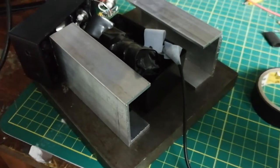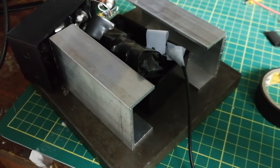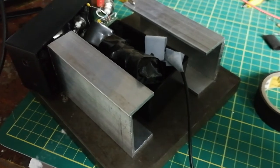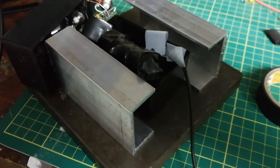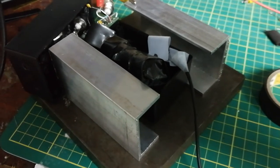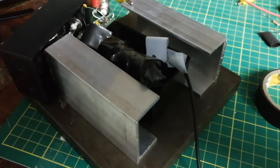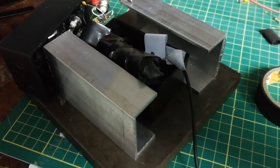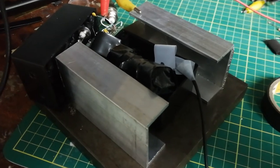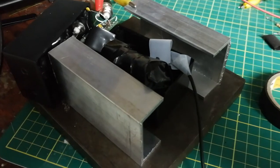Hey, so I wanted to do a quick demo of my PMT test setup that I put together. And this is actually after I went through a bring up process using just the photocathode by itself with no multiplication. I'll probably shoot a longer video about the details of bringing up a PMT, for which you have no data about. But for now, I'm just going to show you that this tube can go into the photon counting region, even though it only has six dynodes.